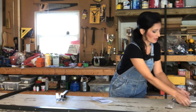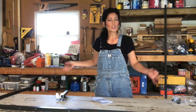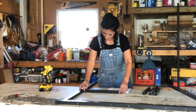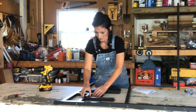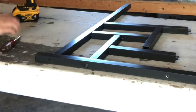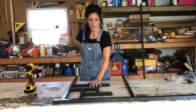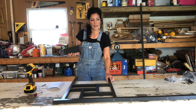The hardware that comes with the trellis has quarter inch hex head screws. As I'm beginning, I'm going to set them by hand and then go back with my drill and tighten everything. I took the first package and did my little trial run, which is right here. I'm going to go ahead and open the next group — it's basically going to be the same thing — and then once you have that in place you can go ahead and attach that bar.